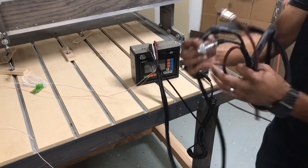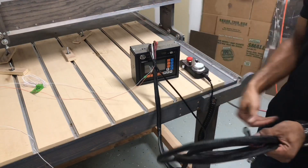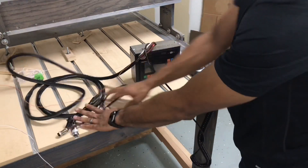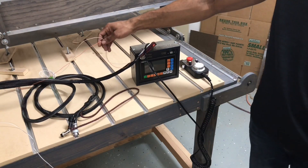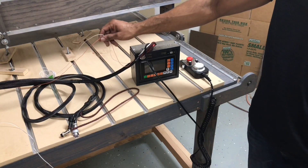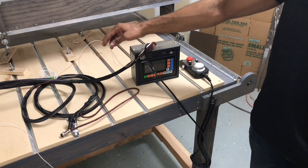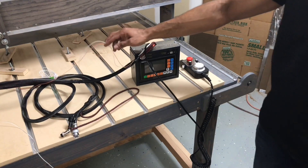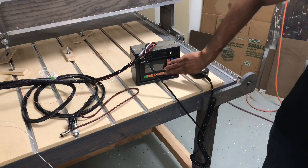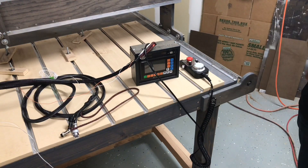This one is going to actuate the power through this button for the water cooling for the CNC. I do plan on going further in depth with an overview of the CNC itself. These two wires go to the VFD, the variable frequency drive, and start and stop it, but do not control the speed. I use the potentiometer, or what can be referred to as a pot, in order to control that directly on the face, so I don't have to go into menus during a program — I can just change the speed with a dial.